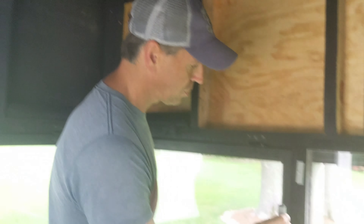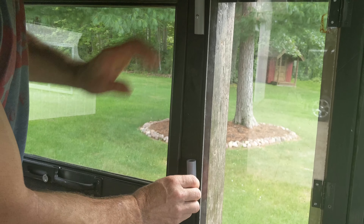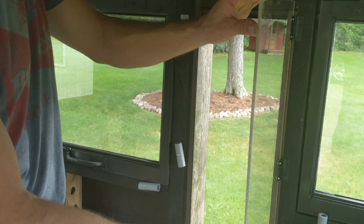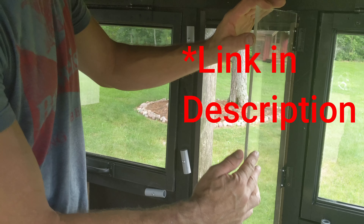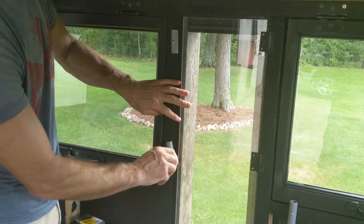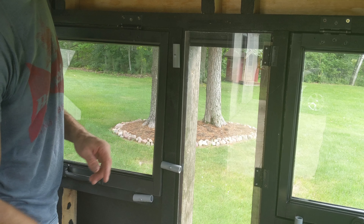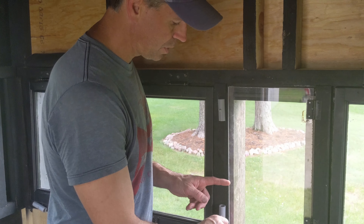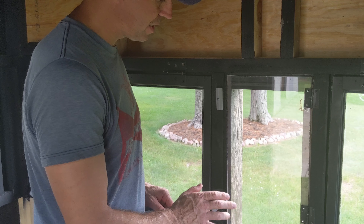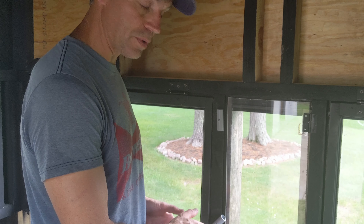What I do is I just screw it to the edge — you can see here, I've got some already. I screw it right to the edge. If you've watched my hunting blind window build out of plexiglass, this is one of those. So when it's closed, it's flush with the interior stud here. You can turn the PVC pipe — it rolls on there real smooth. Once that's screwed into the wooden stud, I've got the washer behind so you don't have friction between the PVC and the wooden stud.